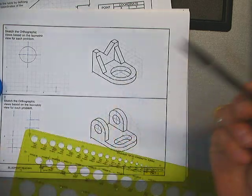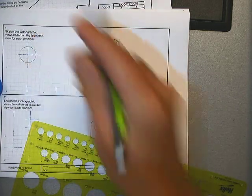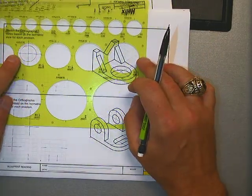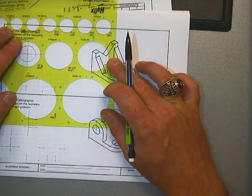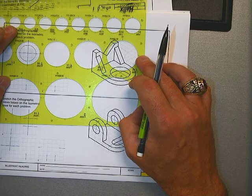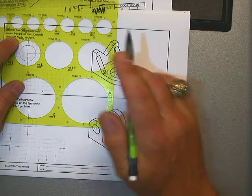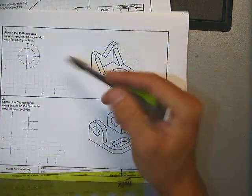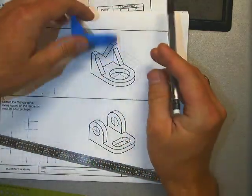You will notice that we also have a curved front on this circle. It runs clear to the outside edges. So from this point to this point to this point. Remember, a curved line changes direction at every point. That's how it's on here, so we're going to put that on here. Now this time I'm not going to go clear around. I'm going to go 3/4 of the way around to line up with my drawing. Neither one of those is quite perfect. We're going to try the 1.25 from there to there. I now have the front and middle circle.